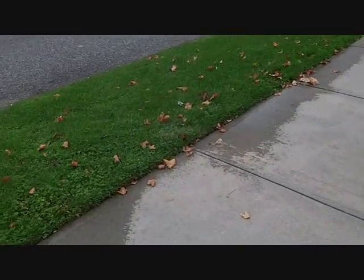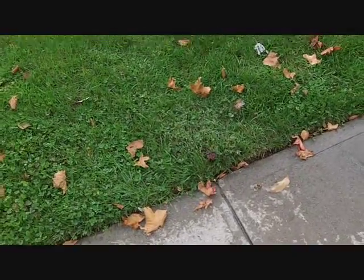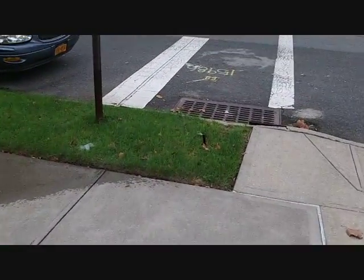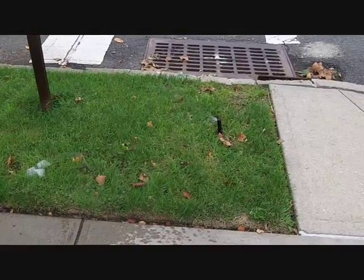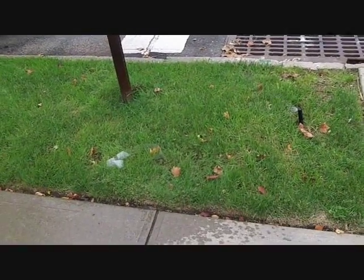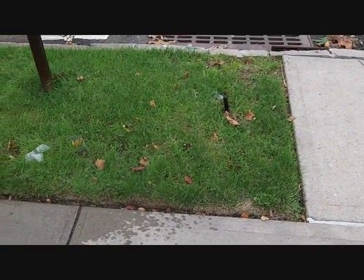So this sprinkler's already out. This is the first of the series, so the water's out of this. There's still water in this one. Compressor just kicked on again. So you just put it on 40 pounds per square inch. I live out in New York City, so that's pretty much what it takes. That's what my water pressure is.